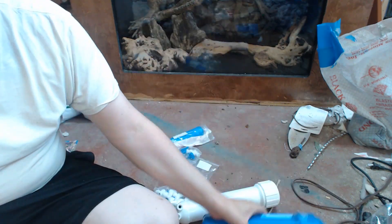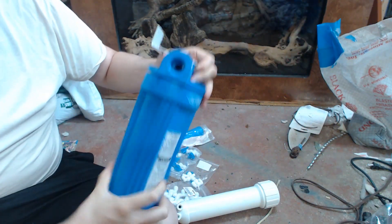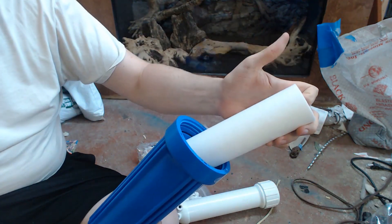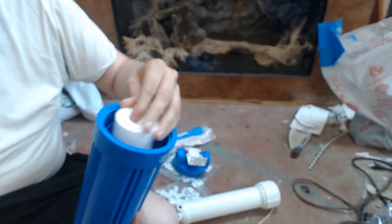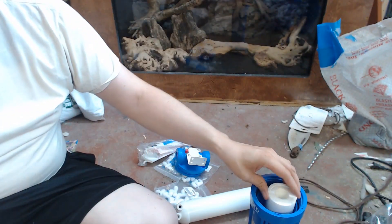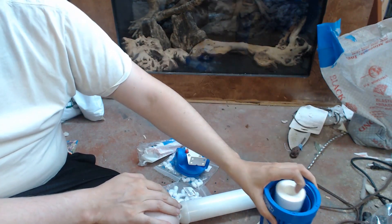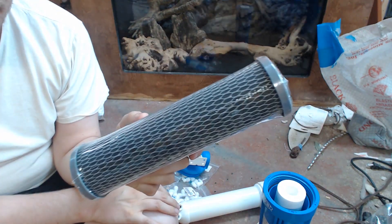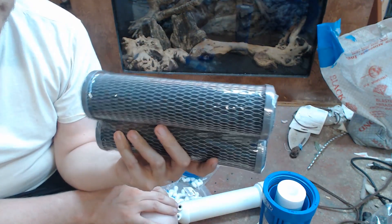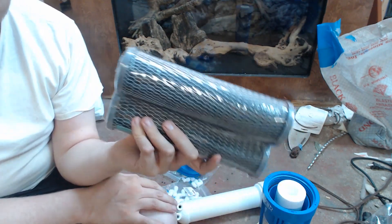These cartridges are universal. I like to use these big blue DuPont cartridges — they come with a sediment filter which does not filter chlorine. On my setup I've got two of these: one sediment filter, then the next one with a charcoal filter going after that. The sediment filter has a 10 micron hole size and the charcoal filter also has a 10 micron hole size, so the only thing my charcoal gets used for is chlorine removal.